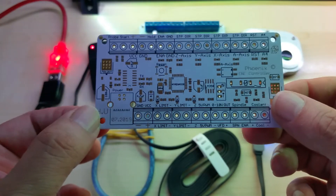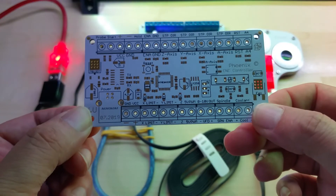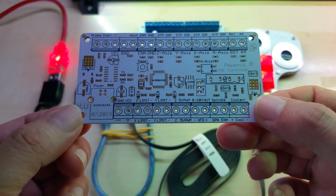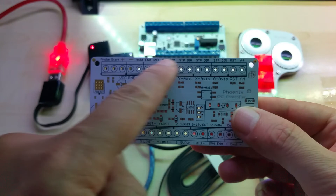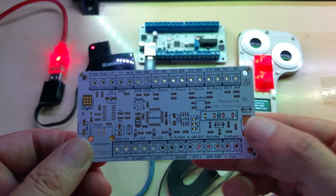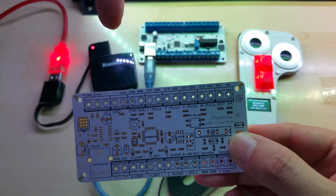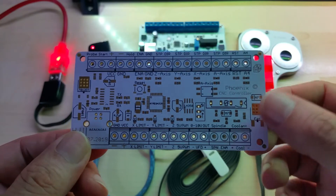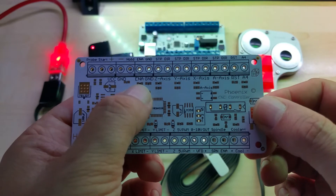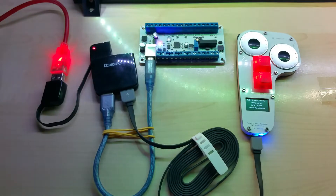This is a 24-volt board because the usual steppers used with this are the DRV8825, and those are perfectly fine with 24 volts. I also changed the pinouts on the top. I'll now make a new PCB for the stepper driver board which will connect directly here. You have two inputs for the power — if you connect the motor shield you can connect it from the top or from the bottom, it won't matter. Everything else stays the same on the board.